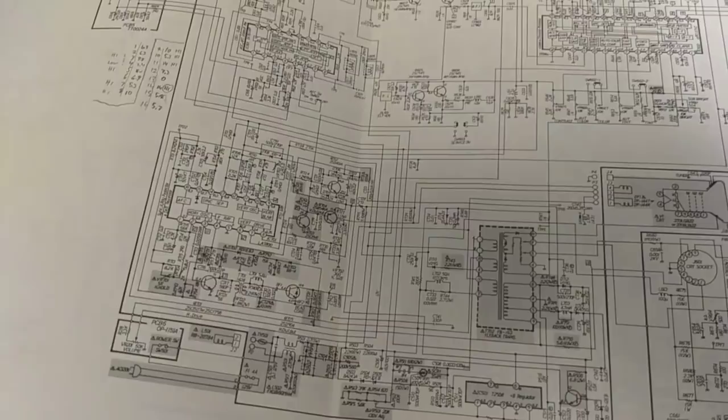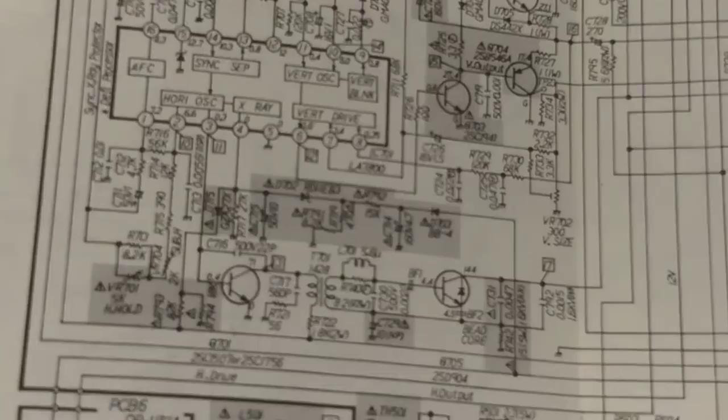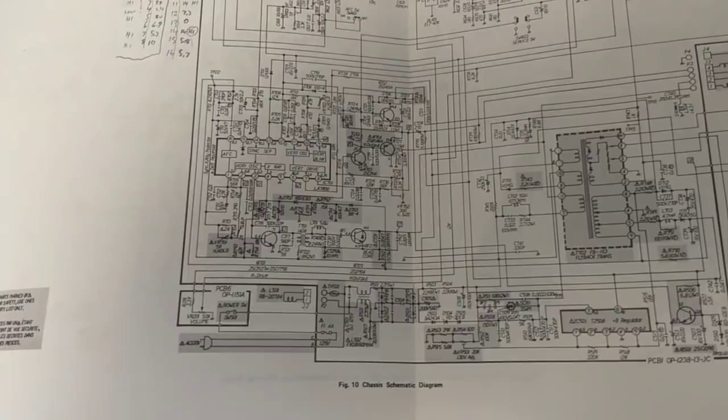There may be some sort of feedback derived from that line. But with a really strong signal I get my colored bars — my rolling color bars — back. But still no color. And I've got what looks like a giant fat white blanking thing on the left side of the screen. This certainly has been a pain in the ass. I've never had such difficulty with a no-color symptom like this. Definitely trying.